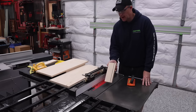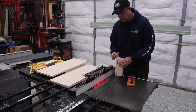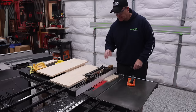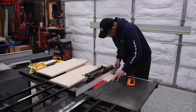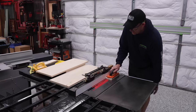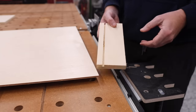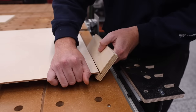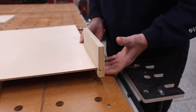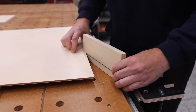This last piece I just cut is a scrap of the same material I'm using for the cabinet. Now that I've made my first pass, I'm going to start shifting the fence over and creep up on the cut to get exactly the right fit for the panel. I don't want to overshoot it, so I'll use this scrap to test. I'll move my fence over maybe about a sixteenth of an inch, make another cut, and then test it before cutting the rest of my pieces. What we're looking for is a nice snug fit but not too tight — and that actually looks really, really good. Now I can go ahead and make the cuts on everything else because the fence is already set.